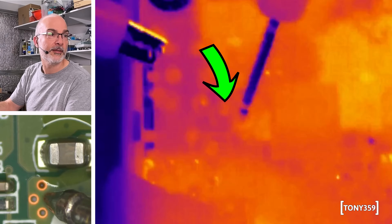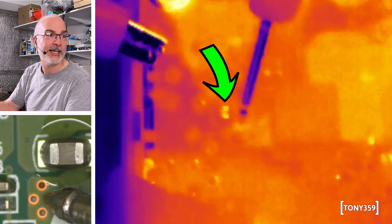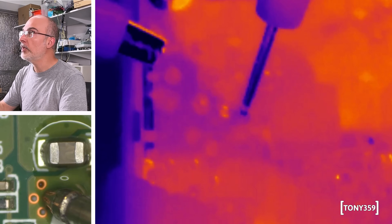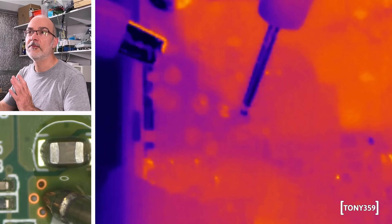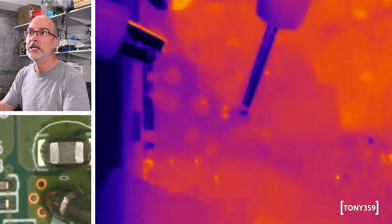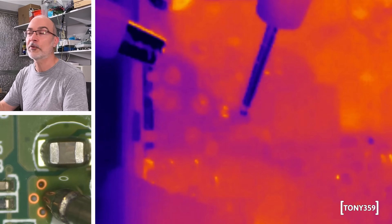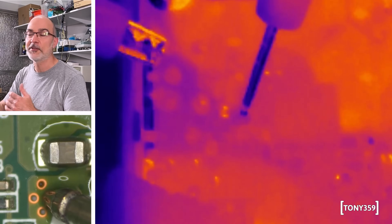I don't see much with the thermal camera — that's a reflection on my hand. It should be glowing on the thermal camera; that's interesting. It's interesting that you can barely see it glowing. This input is rated for 20 volts, so I'm being very conservative — right now my power supply says 0.36 volts, obviously that's a short, and 800 milliamps. Again, it's pretty obvious from the alcohol that this is our problem. I thought the thermal camera would be a much better solution every single time — that's kind of new to me. Let's remove that capacitor and see if the short goes away.